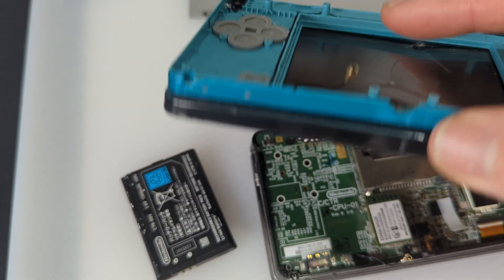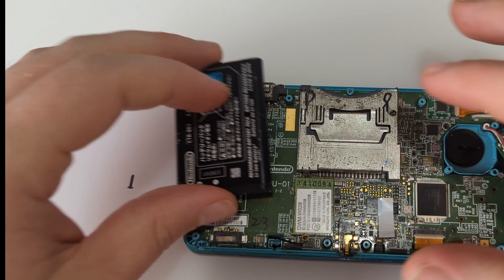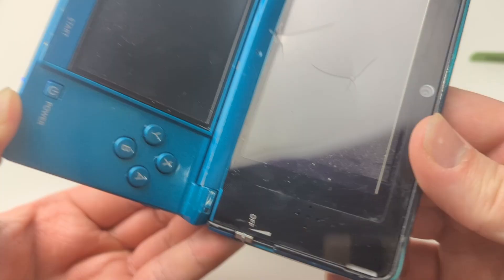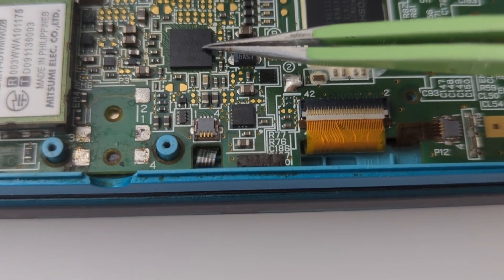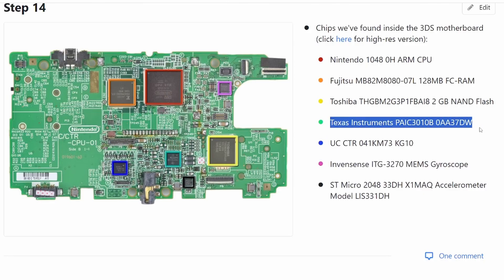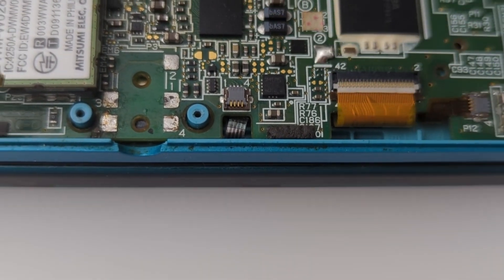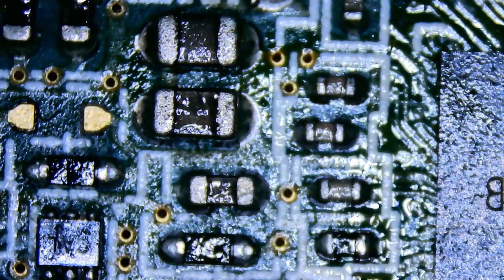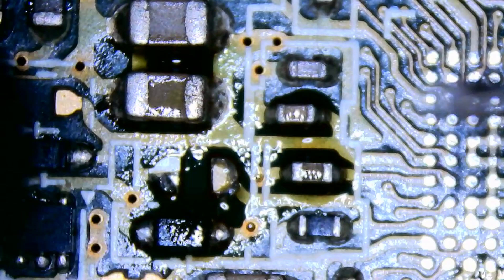What we're looking for now is the noise — please be gone. Another top half assembly, I'm going to dump it in this one and see what it does. We're in the blue frame. According to the internet, this chip here is the one responsible for the sound. I'm just going to probe this area with the multimeter and see if any of these things give a different reading compared to our donor board. After probing the area, the only thing that really stood out and gave me a different reading was this little cap here.